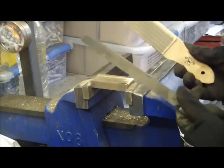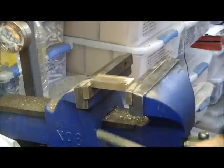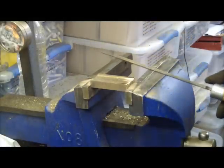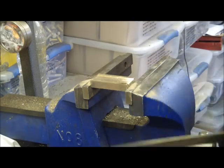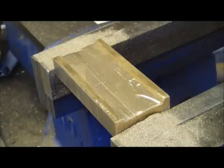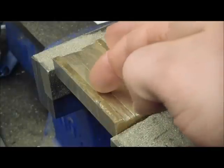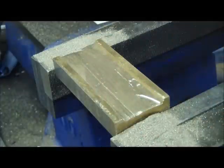We're going to go ahead and file this. I'm cleaning off my file with the card to eliminate the chips. The file is really hard steel and it's actually cutting material out of there. You don't want to just rub it over top — you want the file to work for you, so you've got to have good body positioning and give it some down pressure. We've got ourselves a nice little pile of bronze filings, and there are a few apprentice marks I'm not really happy with, but not bad. I went too deep with the hacksaw there.